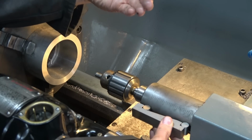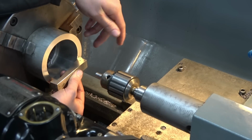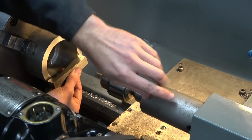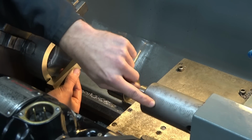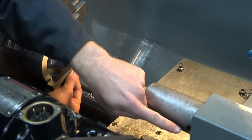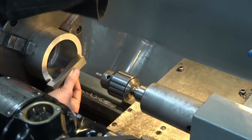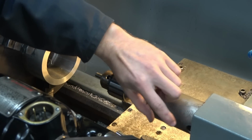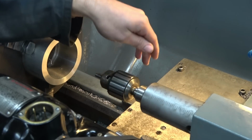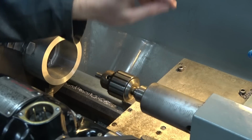Those are considerations, but you do get a good sine bar, and let's say you have a face you've machined, a sine bar, accurate slip gauges. That is probably unbeatable as far as accuracy goes, because there are going to be errors in measuring on a round surface. There are going to be errors in the tailstock's alignment, and as pointed out in the comments, you might incur errors between dialing it to 0 and then trying to replicate the 0 reading here. More error points potentially. The beauty of the tailstock method is that all you needed was the DTI, which typically you would already have out anyway, whereas all this is extra. Was I going to do another one tomorrow? I think I'd work off the tailstock quill again.